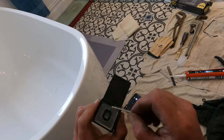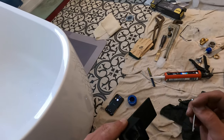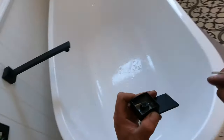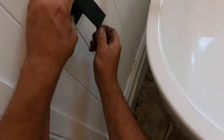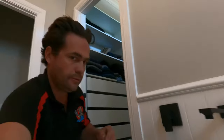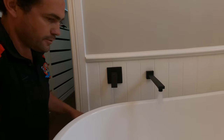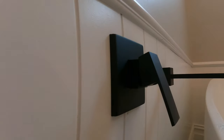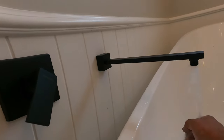That's a stainless steel grub screw inside a brass body — or it could be aluminium; bit hard to tell. If it's aluminium that's even worse, because aluminium doesn't play well with anything — just wants to oxidise and seize. Water's back on. That looks fine and it's doing really well. Hot's hot, cold's cold.